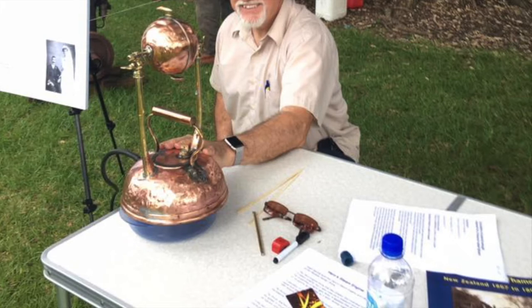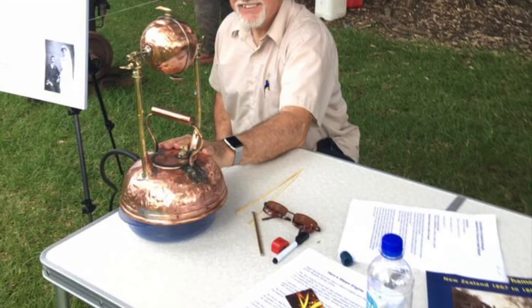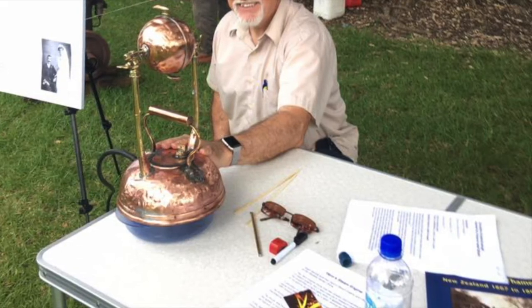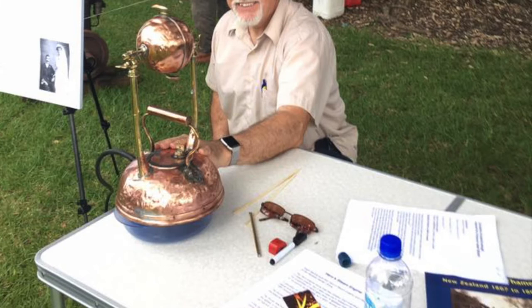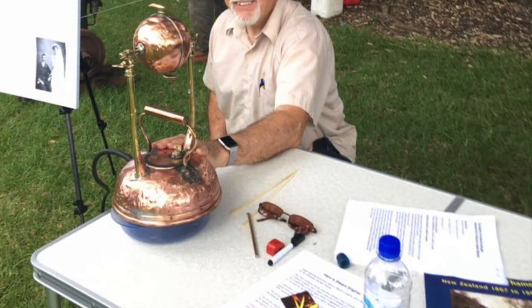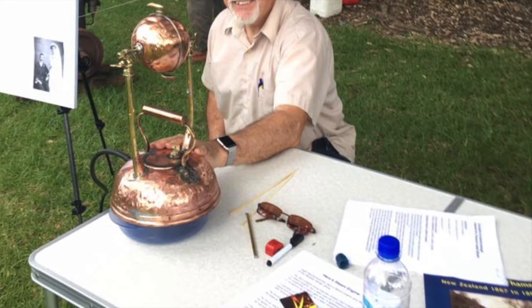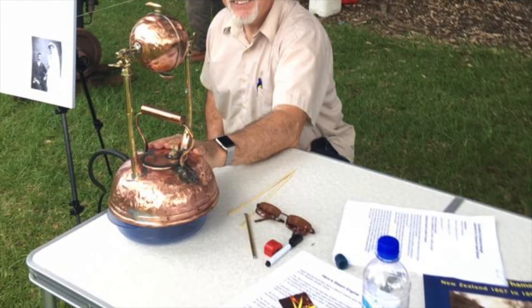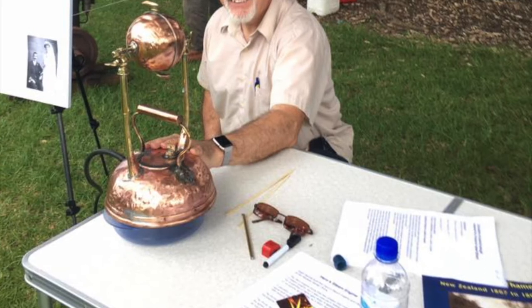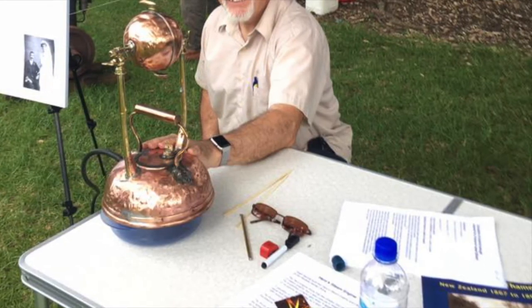Following in my grandfather's footsteps, I took it to a steam show and it raised quite a lot of interest. I did about 40 pages of calculations on this thing and found that when the gas leaving the jets reaches the speed of sound it can't go any faster, and surprisingly it only takes about 10 to 14 pounds per square inch — that's one atmosphere — for it to reach the speed of sound.